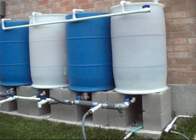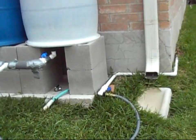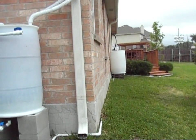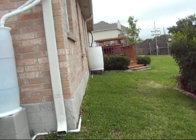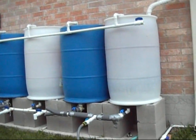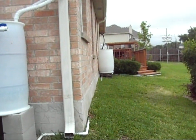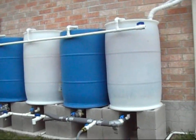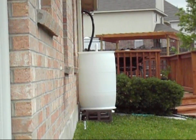The garden is over on the other side of that pergola. I hooked up this hose to that line, which I can also shut off and disconnect, so these four rain barrels can be completely separate from those two rain barrels down there, or they can all be connected. When these are full they act as a reservoir, and this hose keeps those filled down there, which is closer to the pump, giving better water pressure. Everything's level — I leveled it off the house. The lower ones aren't as high on purpose because they're not as visible.